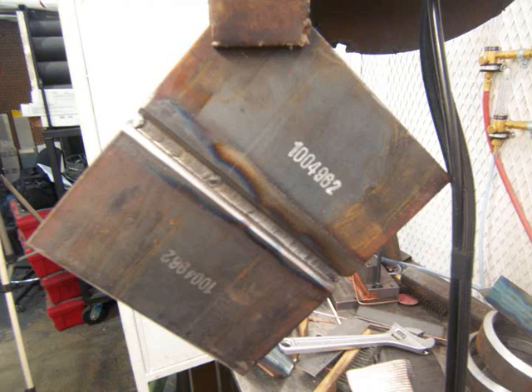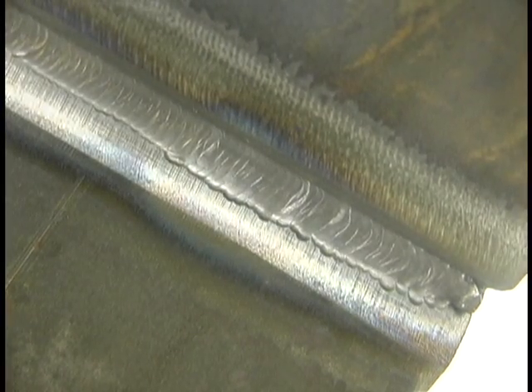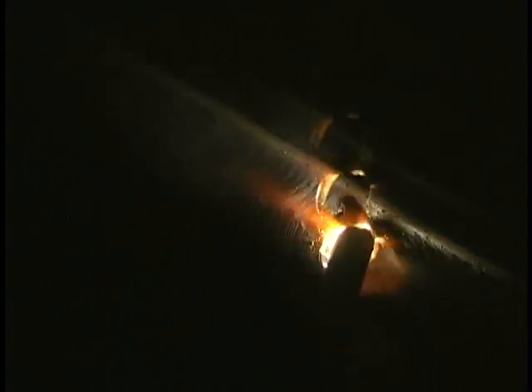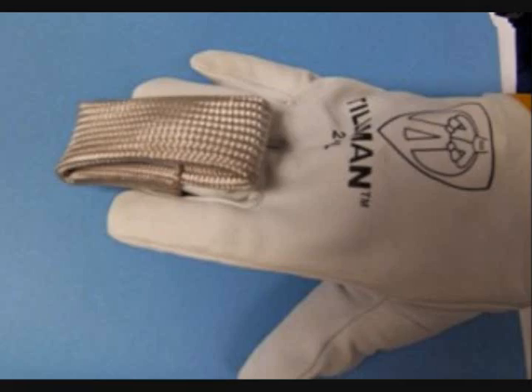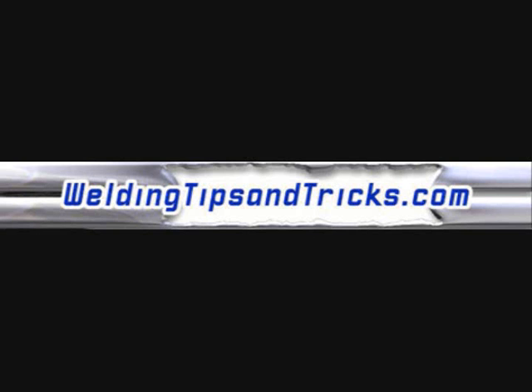Both work. Once you get the root pass done, about the same heat works for the hot pass — within five or ten amps anyway. That is very good practice in preparation for pipe welding TIG root pass and hot pass. You can then position it any way you want and start your stick welding if that's what the test requires. We'll do more of that in the next video. We use the TIG finger heat shield for free-handing these root passes and it works great. Thanks for watching weldingtipsandtricks.com.